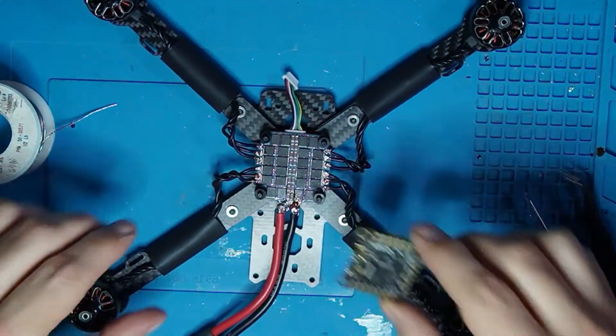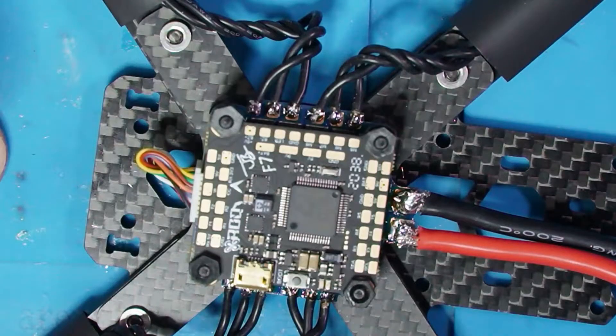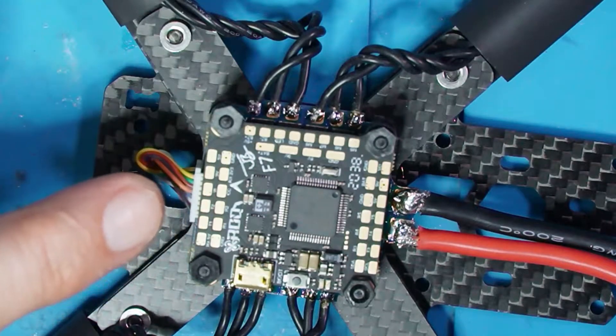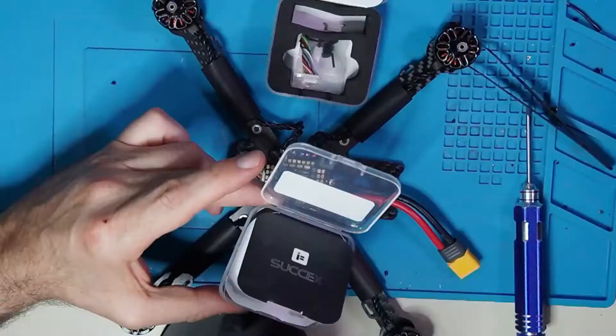We want to make sure that we put this thing on with the arrow pointing to the front of the craft. When it comes to all-in-one ESCs, you're going to want to look at the pinout diagrams for both the 4-in-1 ESC and the flight control board, just to make absolutely sure that everything lines up the way you think it should. Normally when you buy things as a stack or as a kit it should be fine, as in the case of this one, but I still double-checked. Here is the pinout diagram for the two pieces — the iFlight and the flight controller. One of them is reversed, but ground goes to ground, next is VBAT, then the four motors, then current, then R4. So you're always going to want to check that.